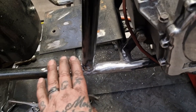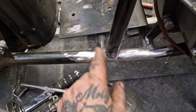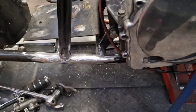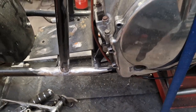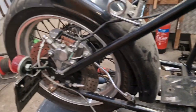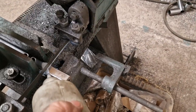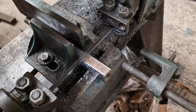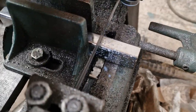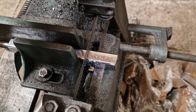I'm going to come across this side and I'm going to use my finger sander — finger file — to clean off the paint so we can fit the rear foot peg mount. So next up we have the foot peg mounts. I've got these really long mounts on there, so I need to cut 45 millimetres off. I'm ripping it off in the bandsaw — it's not going quick.